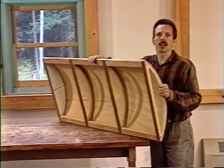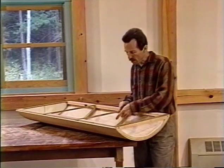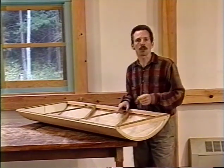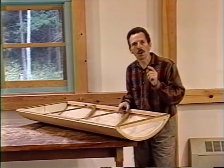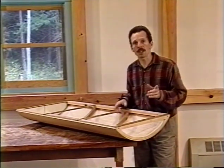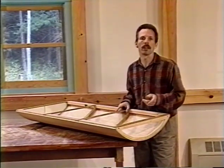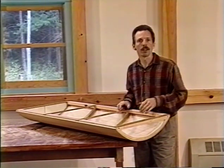Those 6 inches on center ribs are unnecessary. Only a few of these 3/4 by 3/4 inch arched ones are needed, just enough to hold the skin in the shape you want. The advantage of this method is obvious. It cuts down dramatically on the material and labor and keeps the form quite light.